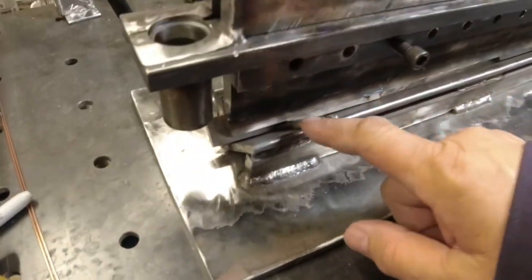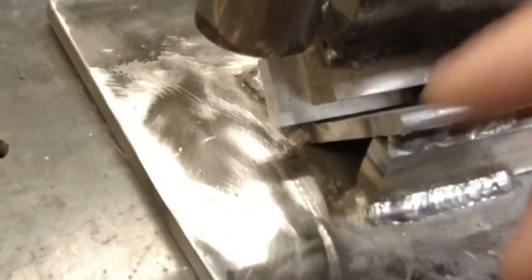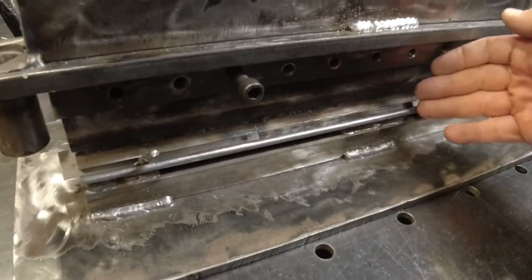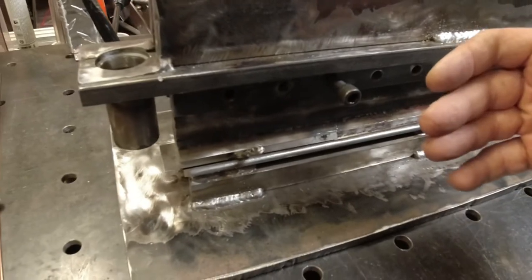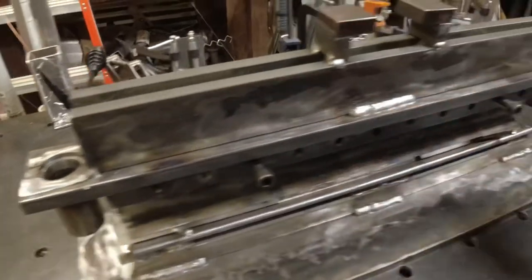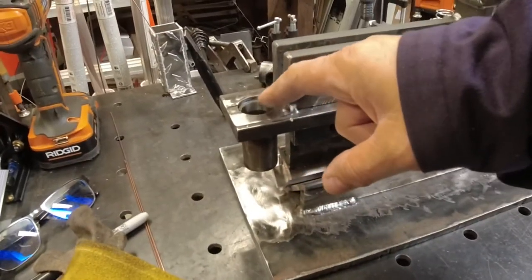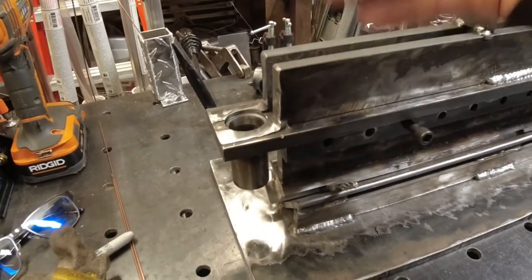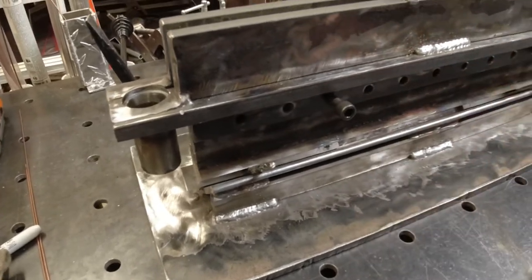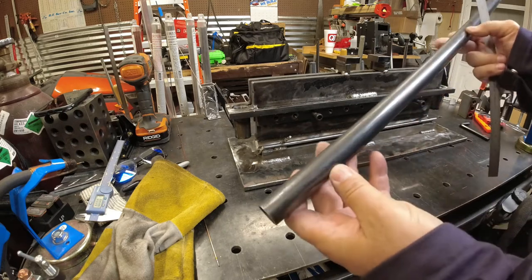What we did is put the quarter-inch bits in the front and the quarter-inch parallels in the back. That's allowing the finger itself to sit in the lower shoe and center it, so we know we're in the right spot. That way we can get a measurement for the new pins. The new pins are going to extend out, giving us a lot more travel so that as we make new fingers for various things we can have whatever length we need. The material is just ERW tubing.